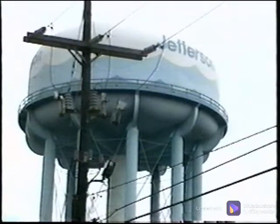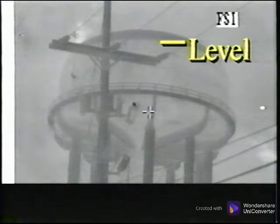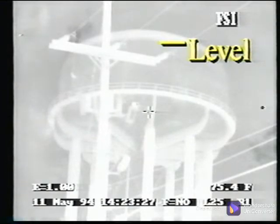Storage tanks have their own set of peculiarities and sometimes present special challenges, one of which is determining the product level. If the tank is outdoors, survey it at night when the air cools the tank down to the product level. The contents will be warmer and indicate a definite thermal differential. If the survey must be performed in daylight hours, choose a sunny day when the sun heats up the tank surface, but the product does not absorb the heat quickly and will indicate a cooler temperature.